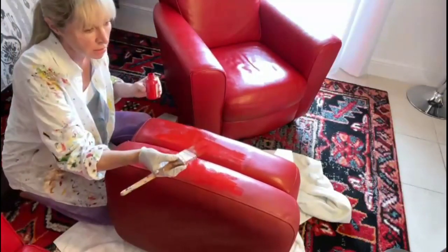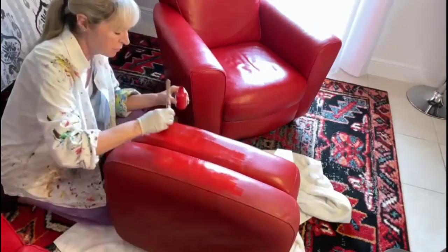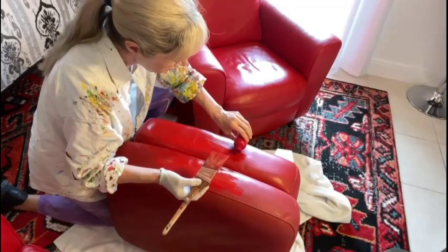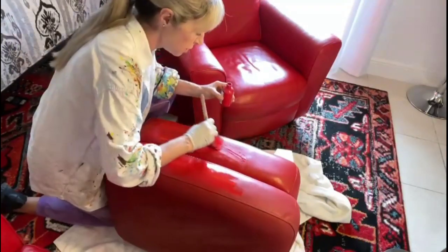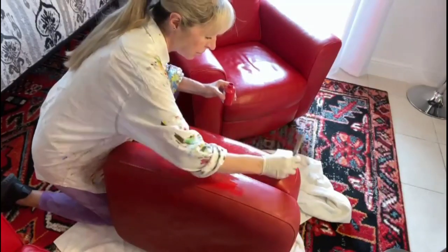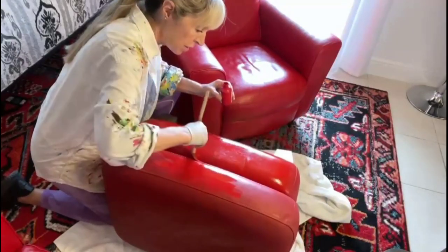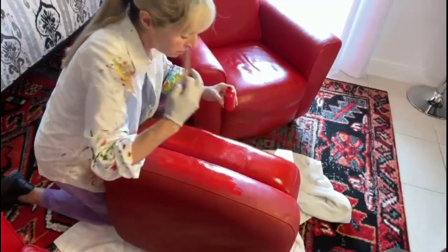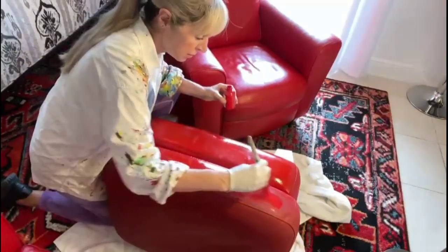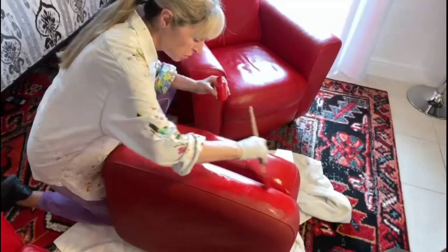I'm using a really good cut-in brush that I bought at Home Depot. This is a much better brush versus the disposable brushes. I found in my last project that when I used the disposable brushes, more bristles came off. If you are going to use disposable brushes, you really need to be very cognizant — if any bristles come off and get stuck, you have to remove them immediately. So I just find it's better to use a better brush.